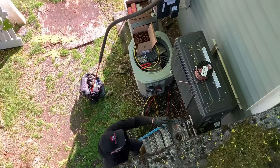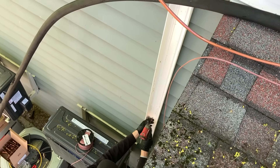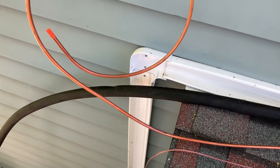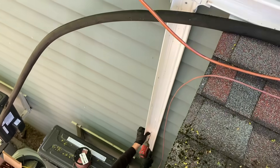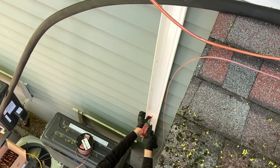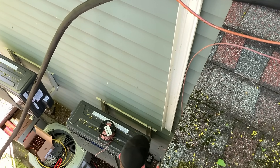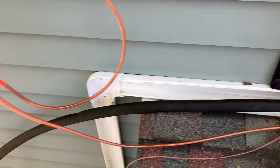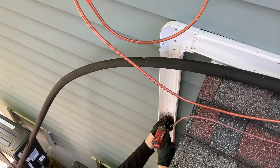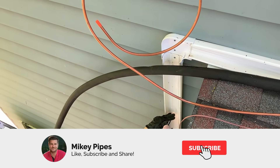Positioning the line set cover — pull it out a little bit, go over a little bit, make that nice and parallel. Some Instagram influencers in the HVAC world would use a laser level. I'm good. Throw a few more screws in there, we'll put a bend here and bring this three-eighths and three-quarter down.